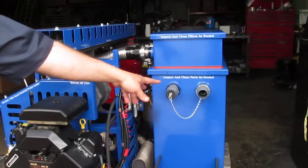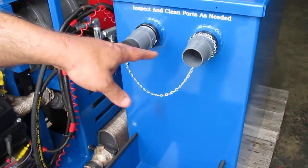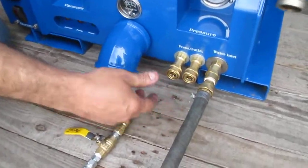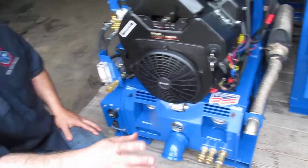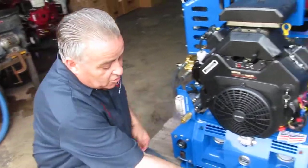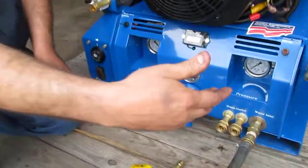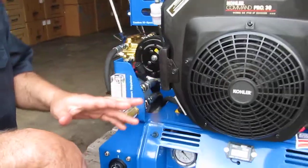This system can be driven by two technicians or a single technician. You have two vacuum ports — you can combine them together to get maximum airflow toward the tank, which is useful for going long distance. However, you can also run two independent technicians off each port. You have two pressure outlets in the front, which you can hook up to two tile and grout cleaners, two wands, one wand, one tile and grout cleaner, one furniture tool, one carpet tool, whatever combination you need. If you want to do water extraction with this system, there is no reason to hook up water or turn the pump on. The pump will only engage if water is present — even if you accidentally turn the pump on with the water off, the pump will not engage. So you can run this machine dry without any water connected to it.